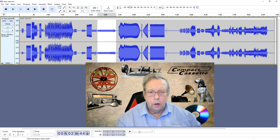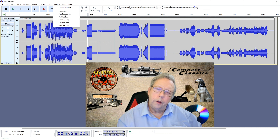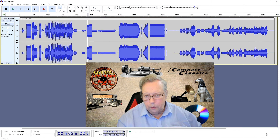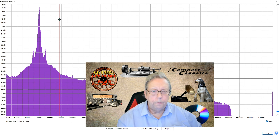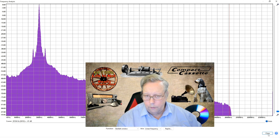Let's have a look at the one kilohertz total harmonic distortion - or third harmonic distortion, should I say. Have a look at that. This is quite high - this is at zero dB - and we've got distortion on three kilohertz at minus 36. That's going to give you a little bit of shrillness, which I did notice on the playback. Let's go on the three kilohertz and have a look at that. You've got nine kilohertz which is the third harmonic, and at zero dB that's at minus 48dB. Not quite as noticeable because it's high frequency, but nevertheless it's there.